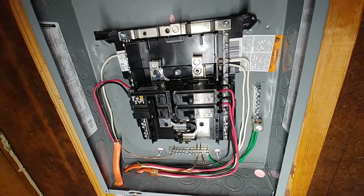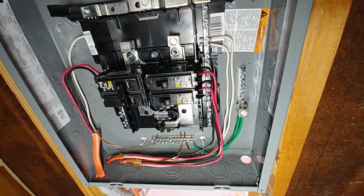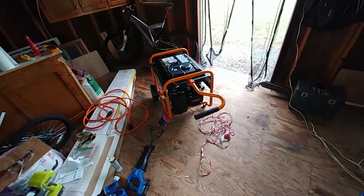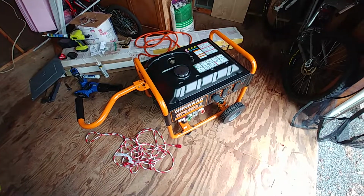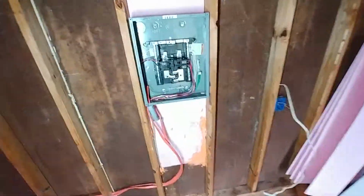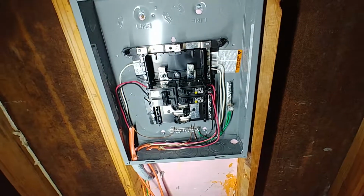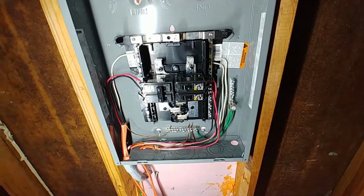And the reason we're not connecting the bus bar for neutrals and grounds here is because it's a separate ground, and my power source for the time being is a generator. I plug it in on the outside of this building with a 14-30 plug, and this one already comes bonded. So since it's my only power source, and my power source is bonded, I don't bond the panel, from my understanding. What's coming next is going to be a battery wall that the generator can charge, or solar can charge. So a lot of this may change as my understanding changes.